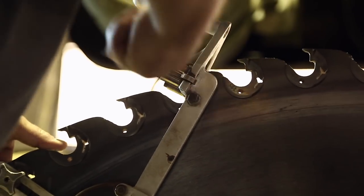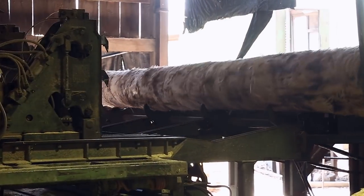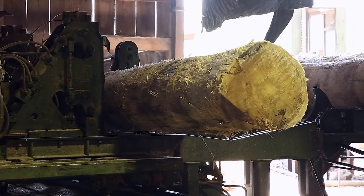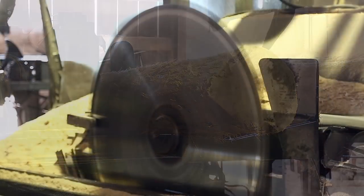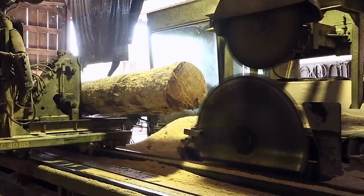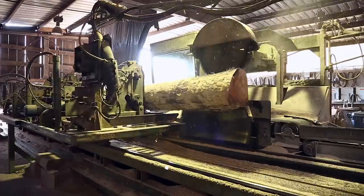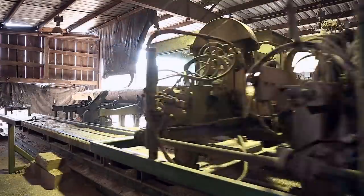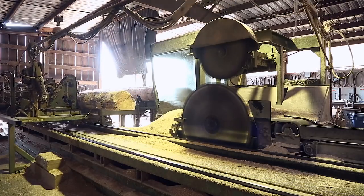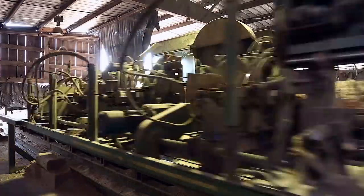You remember last week we were out at another mill — a little band mill, actually a much smaller mill than this, but still capable of sawing some very nice lumber. This mill right here is a real production mill. I call this a rotary mill — it's got a rotary blade. The major difference is that on this mill the log is on a carriage and it goes back and forth in front of the blade, kind of like a railroad car, trimming off pieces as it passes the blade. On the other one, the log is sitting still and the blade does the movement.